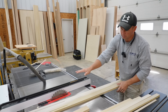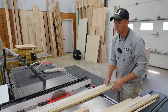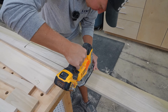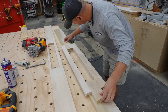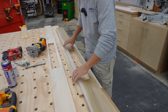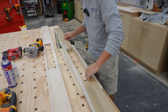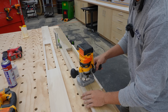Raising the blade at the end makes a more vertical cut and lets me get closer to my pencil line. Don't start with a blade this high — you're asking for trouble dropping the board down onto it. Next, finish the cutout with a jigsaw, again leaving about a 16th inside the pencil line. Then nail the template in place with four 23-gauge pin nails, flip it over, add a clamp so it doesn't move, and go around with a quarter-inch flush bit. That's all there is to it.